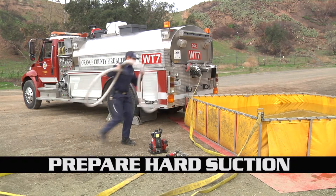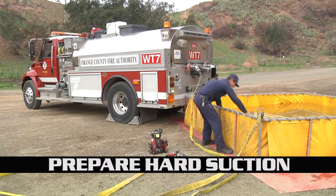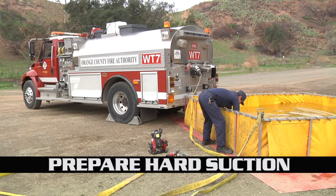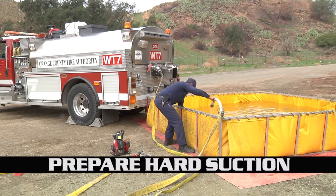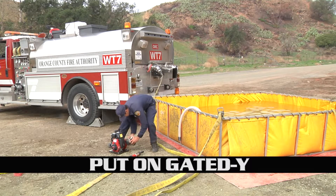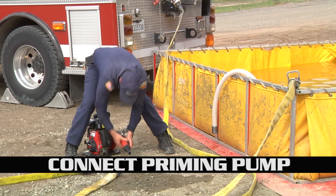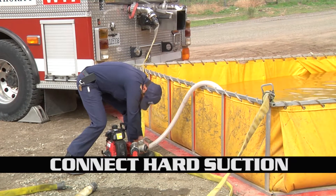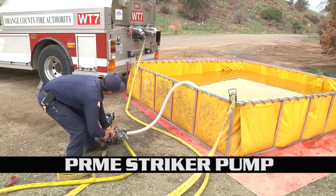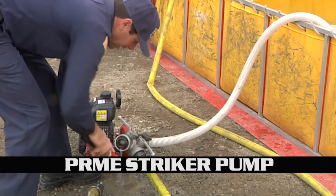With the foot valve off on your hard intake hose, you can pretty much set it down into your water source and fill the hose up by just pushing all the hose underneath the water — all air will evacuate. Put your foot valve on it, slowly bring the hose out, put on the gated Y, hook the plunger for the primer, hook the hose into the intake side of your pump, and we're going to go ahead — I've got sufficient water coming up now. Let's go ahead and give it a try.